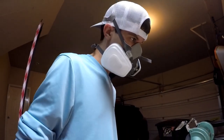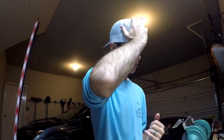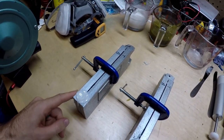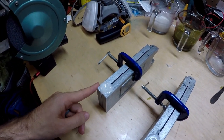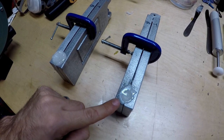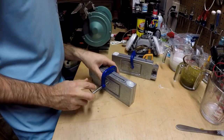I feel pretty good — 330 degrees, I can live with that. Let's inject the white into these molds; we're only doing the bottom half so it shouldn't take much. And now we wait. My neck still hurts pretty bad — yesterday I genuinely couldn't move it side to side or up and down at all, but it's a little better today. I've got concerns about one mold — I don't feel like it shot all the way. This one gave me back pressure too quickly; the other one I feel really good about. Let's give them a couple more minutes and then crack them open.